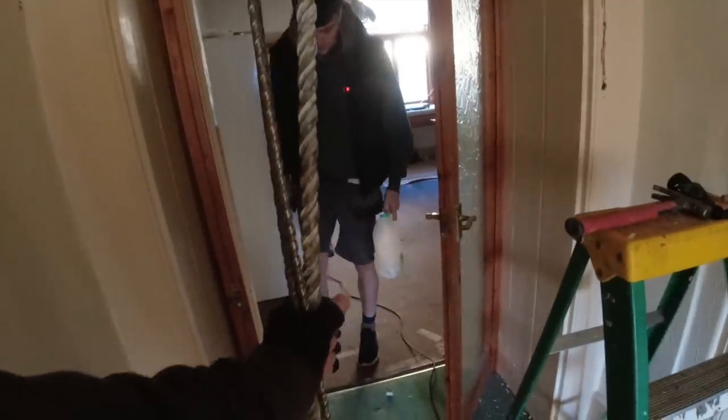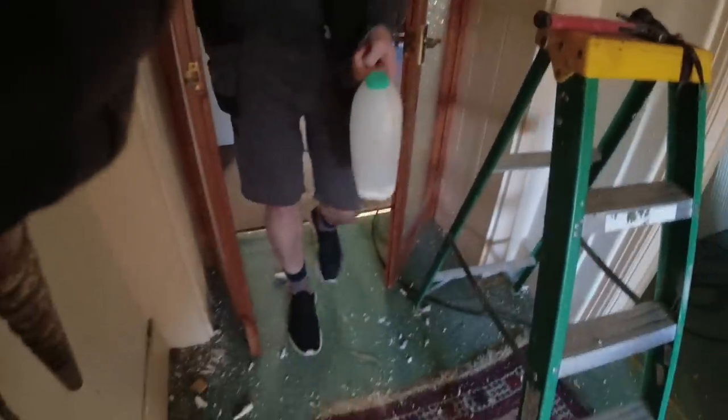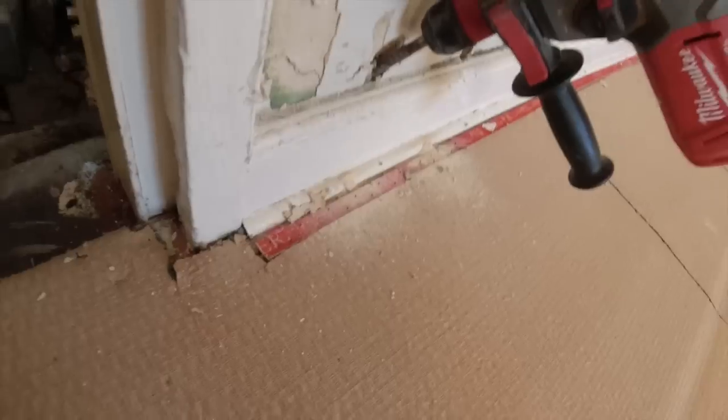That's where we are and that's where we need to go — probably not far off half a metre. That's why we have these one-metre-long drill bits. We're drilling this bedroom socket, trying to come out in this floor, but we've got these big old joists in the way and I don't think there's a gap under there.